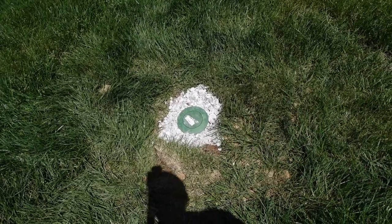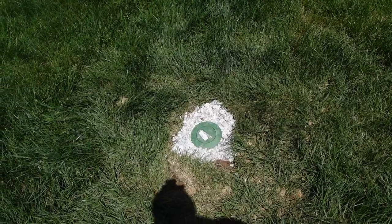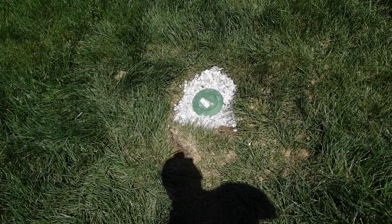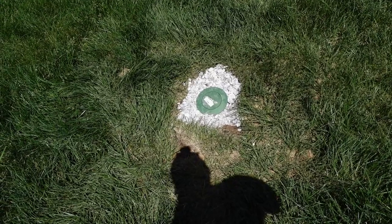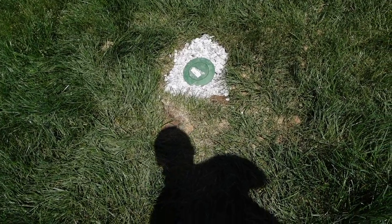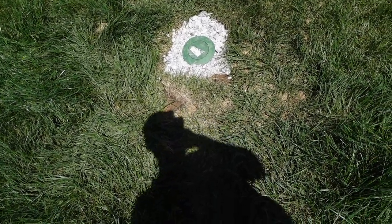So if you guys have a sump pump, we have a double sump pump and a grinder, I would just make sure that the place where the water comes out is not leaning or falling back on your house, and get it to go away from the house, because that can cause major foundation issues, okay?